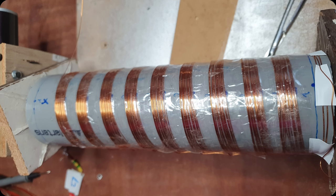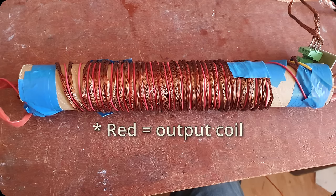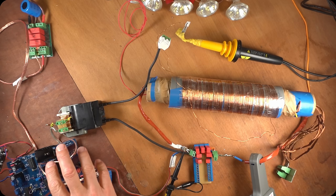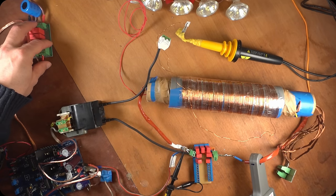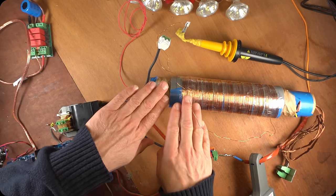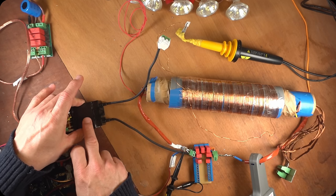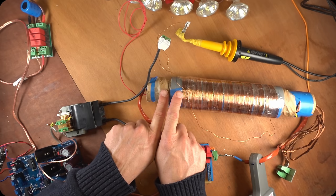Here you can see the build up of all the layers. This was a very labor intensive piece of work to get this coil done. The output coil is wound in between the windings of the high current coil, though I think the output coil should actually be on top of the high current coil. The PCB gets its own power from a separate power supply — 16.6 volts drives the whole board. That separate voltage supply and current supply is only for driving the transformer so that I can regulate it. Because these two coils act as capacitor plates, they form a parallel capacitor to this transformer. This AC high voltage transformer, when open ended, resonated at 68 kilocycles per second, but now due to the capacitance of these two coils in parallel, the frequency is tuned down to 15.2 kilocycles per second.